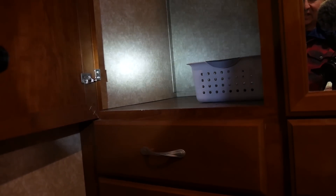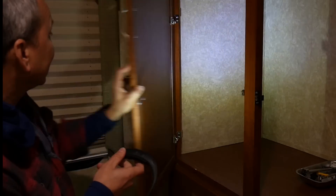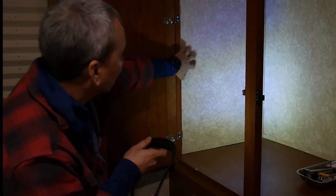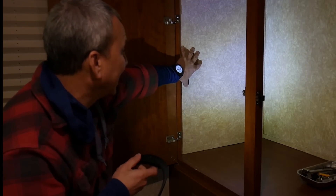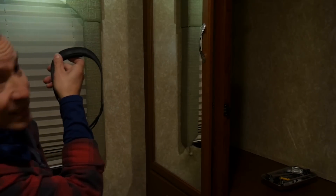From there I can go up through the cabinet. There's a gap to this point which is inside the closet. Now if we look at this a little bit closer, it looks like a wall, but we can see that it's actually a fake wall. Here's the outside wall and there's a gap in between here and this wall. This is a false wall that is quite common in these cabinets because they need room to run extra cables. So what we have to do is remove this panel and what I expect to see is a whole bunch of wiring back there that comes up from the bottom cabinet here and runs up into the top area by the ceiling, which is where we need to go.